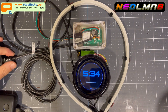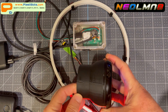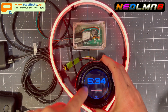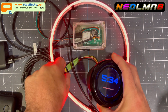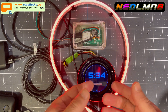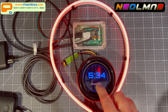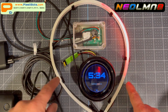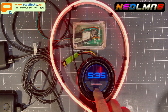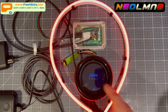Without further ado — I'll turn off the lights a little later so you can see what this looks like — but essentially what this is is a vent-mounted display: a 3D-printed unit where the screen is mounted, with space for air to flow around it. This peripheral here is just an RTC clock. The idea is that this lets me control the strip from inside the car. It has a default state and then I can initiate a sequence from the screen, and when it's done it'll update to running light mode. I can at any time change or save a new sequence.